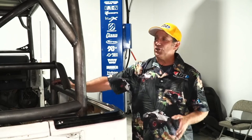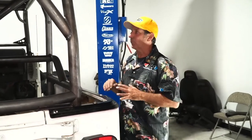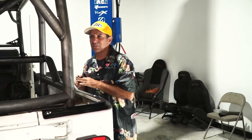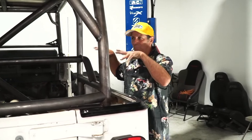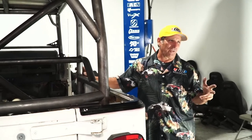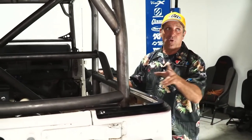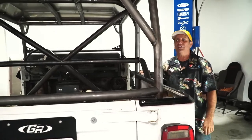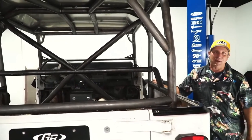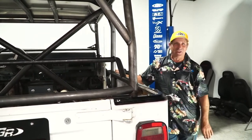Honestly, everybody, if you do the bulk of the work, if you get the interior out, it took us 2 hours to gut this thing. All the interior, the factory cage, everything out, 2 hours. Then it took us 3 hours to put in all the brackets. Getting the prep work done is important. Then we spent another two or three hours tacking it in. It didn't take long, but it is a two-person job, to hold everything up and get the ratchet straps on. I know people have done it by themselves, but it's dangerous. These tubes are heavy, and if they hit you, it's going to hurt. Steve Bird said he did it with ratchet straps by himself, in the garage.